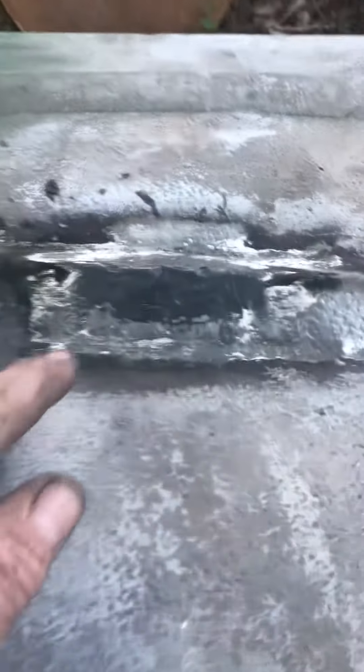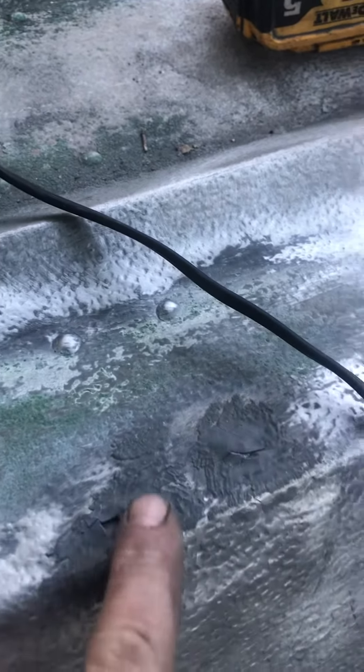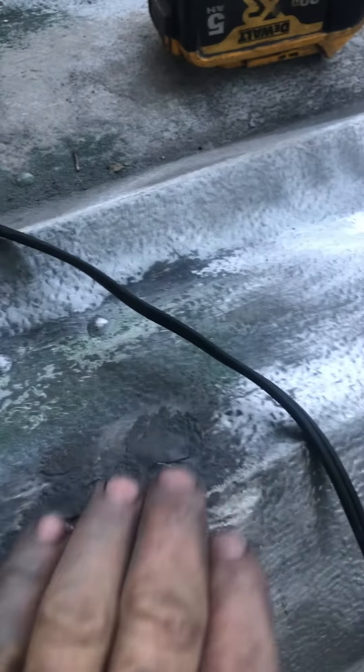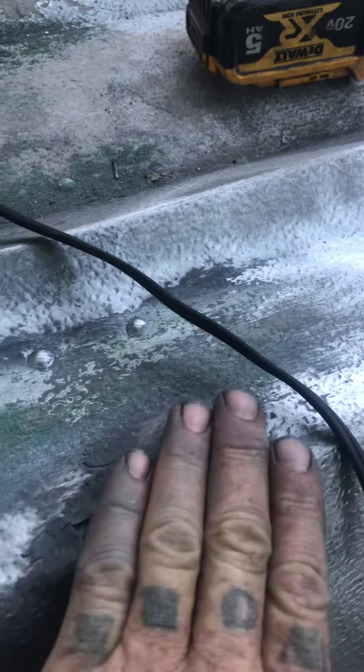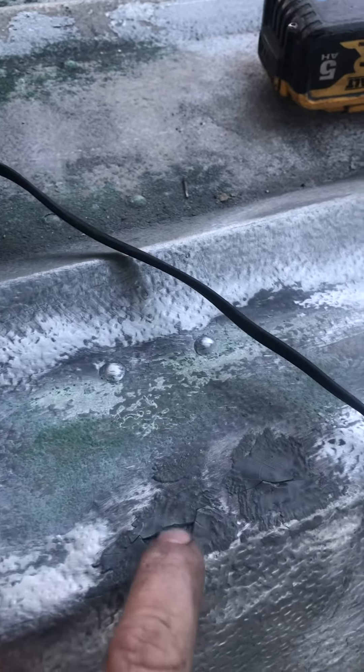So what I did was I put some marine JB Weld on it, but whenever I went and started banging the dents out, it cracked — and so did these right here around these rivets. I put some of these rivets in to test it. When I put the JB Weld on it was flat, so when I put the boat over and hammered the rivets up — flattened them the way they should be — it knocked these rivets loose and busted the JB Weld off. Earlier I could see daylight through it.